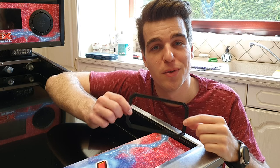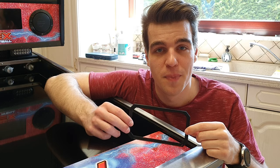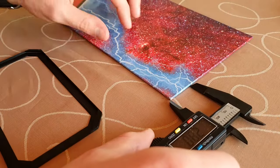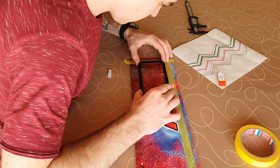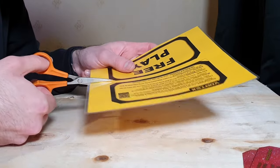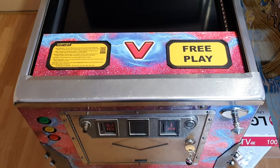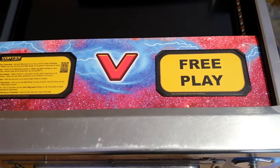Next up, I designed and 3D printed two instruction card holders. Just like on real machines, they'll explain how to play the game — in this case, how to select the game, start the game, and exit to the menu. To install these, I grab the apron and measure where to put the plastic holders so they sit nice and symmetrical. I mark their spot with some painter's tape and then glue down the plastics with CA glue. I then move on to the instruction cards themselves — I designed these myself and printed them on yellow paper, just like classic Stern cards. For extra durability, I laminated them, carefully cut out each card, and slotted them into the holders on the apron. Installing it in the cabinet is a really cool finishing touch — one of those small details that really makes the entire cabinet look professional.